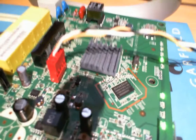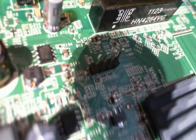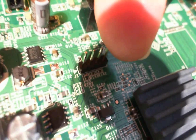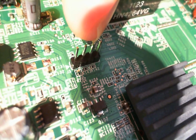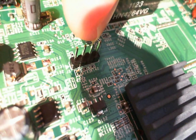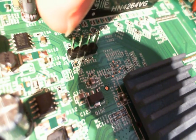This is the Orange Bright Box which has been disassembled to get into the serial port so we can capture what's going on. Here's a 4-pin serial header marked as J1. From right to left that is ground, that is receive, that is transmit, and that one is unused I think.